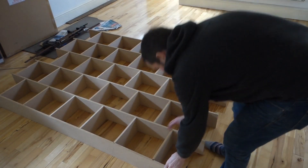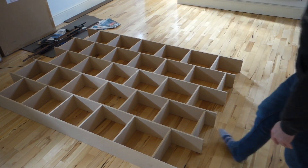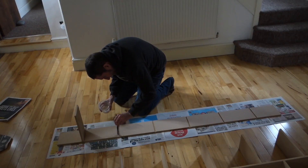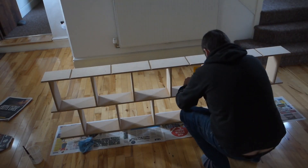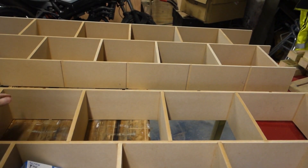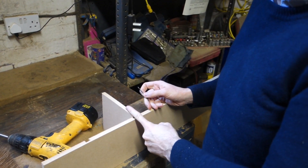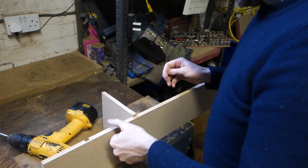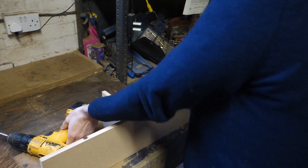There you go — just needs to be glued. The reason I've glued it into two halves is that I wouldn't be able to get it up the stairs. With fibre board, if you put a screw into the end grain or close to the edge, it will split. Because this has got a housing, that should help prevent it, but I just want to check and drill.